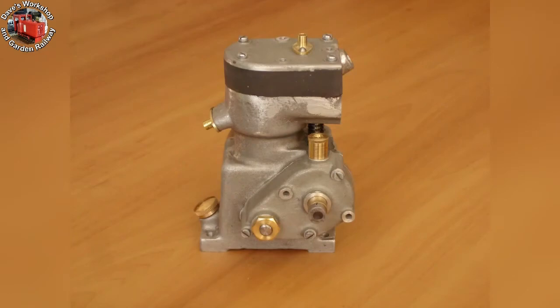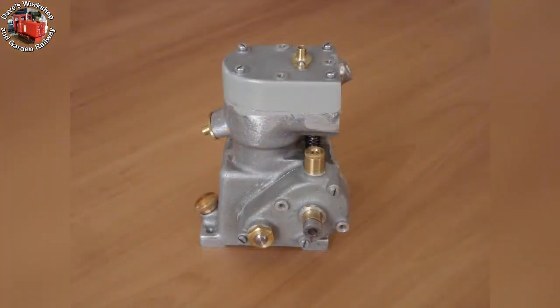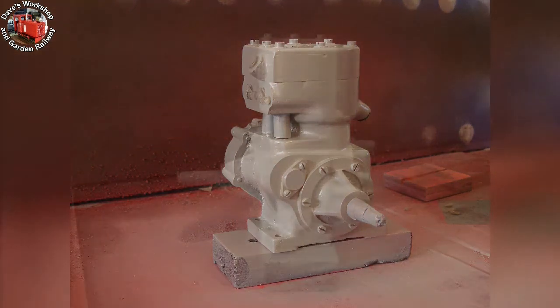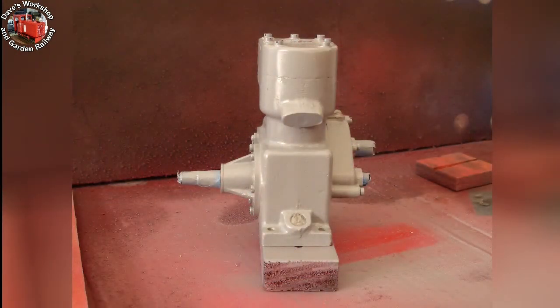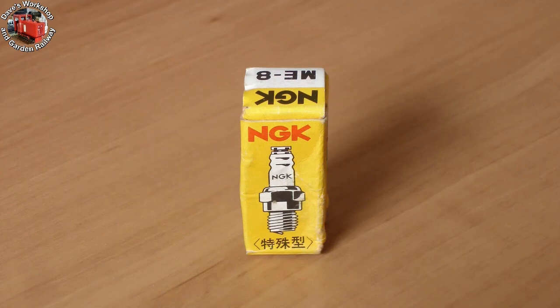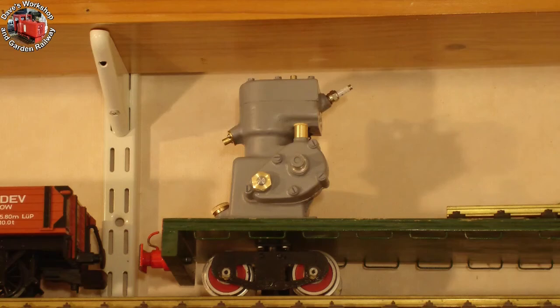I used JB Quick Weld to fill the considerable casting mismatch; unfortunately after curing it absorbed oil and assumed a much darker colour. I experimented with some old domestic oil-based enamel and baked it in the oven at 90 degrees Celsius for an hour — the paint took to the oily surface well. Here we are in the spray booth. I had bought a supply of steel 6BA cheesehead screws for the main fixings. I found a just-as-old aerosol can of Motortek premium spray enamel grey primer under the workbench, and gave the whole engine a couple of coats without the brassware attached. I baked the engine in the oven again at 90 degrees Celsius. The ignition bracket and carburettor body were given two coats likewise. Part of the original kit — the tiny NGK ME8 spark plug. This engine will make a great industrial load for the garden railway.